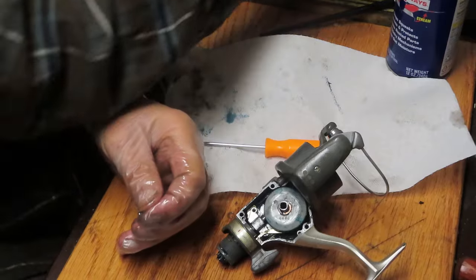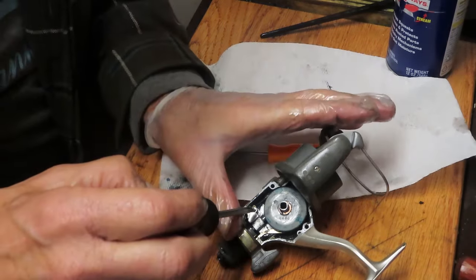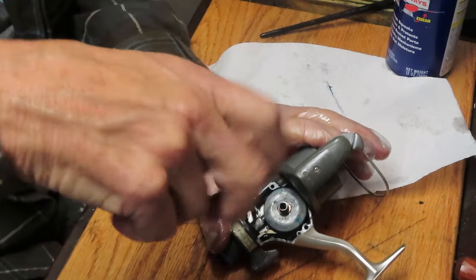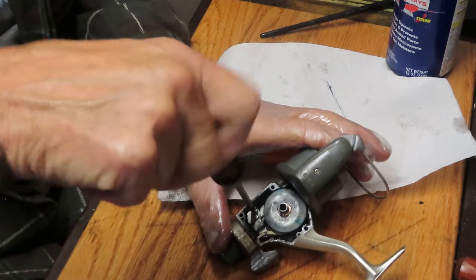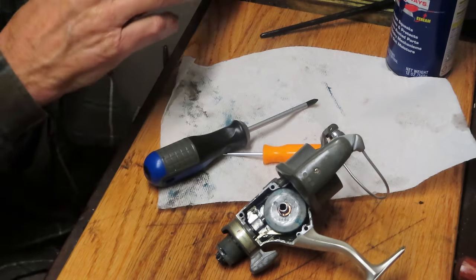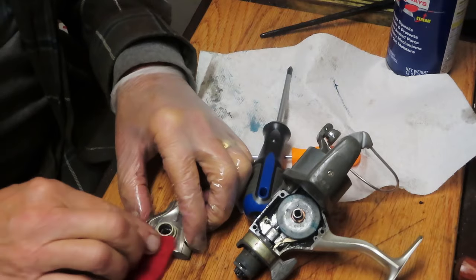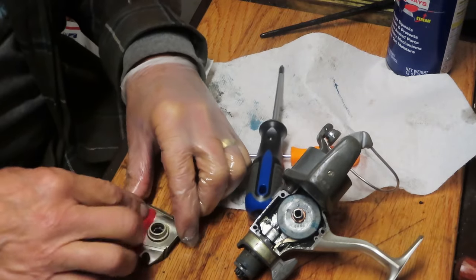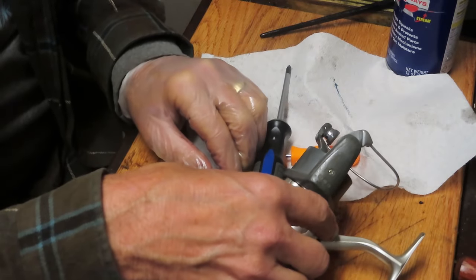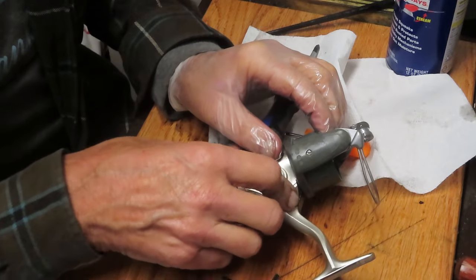See those two indentations? They go high and low on that crosswind block. You need to continue to turn the axle shaft until it seats in that rear drive. Make sure you have a view of both sides for the hooks — don't force anything. If it doesn't close easily like a gate, it's not seated properly. Once you have it in place, get your tie-down clip screw. Sometimes if they're getting started, use a little dab of grease. We can put the case on. The case has got a plastic bushing inside — you don't do anything with that.